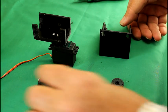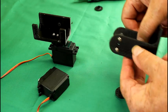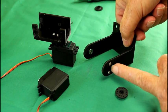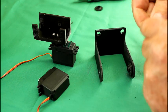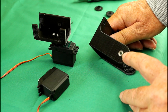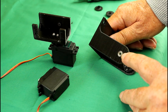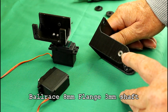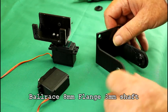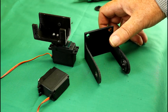For the tilt servo, we again need one of these hubs and attach it to the inside of the arm, centred on the marker hole. On the other side I've put an 8mm ball bearing — you can use that or just use a plastic plug, but it's marked out on the 3D print to use an 8mm ball bearing. We punch the ball bearing in and mount the servo hub onto the tilt tray.